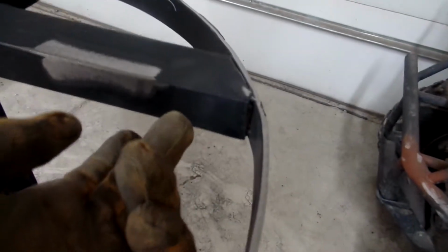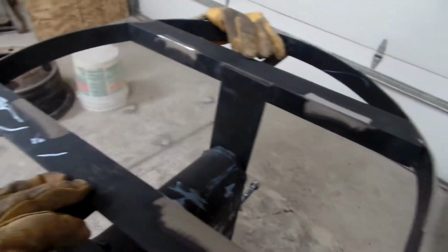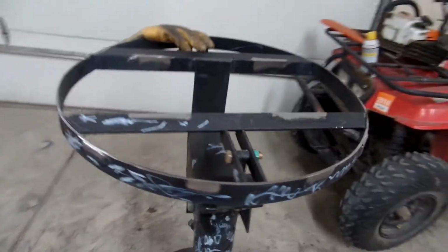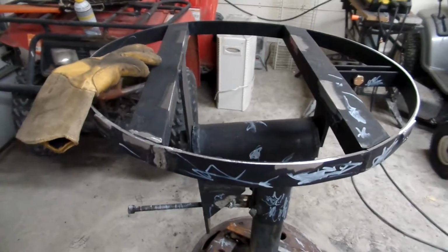If you come in here underneath, say the tabletop is on, and weld this corner, and weld this corner, if you ever have to change that tabletop, getting in there and cutting out a weld in the corner is kind of a pain. So put your welds out where you can get to them with a cutoff wheel or a torch or whatever you got. That makes it easier to repair stuff. Get to it later if you ever have to. Change your mind, change your design. Keep welds out of corners. Makes it hard.